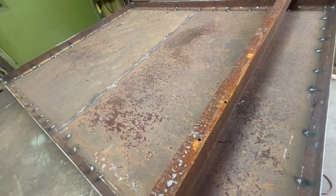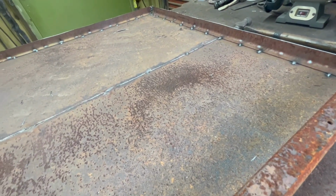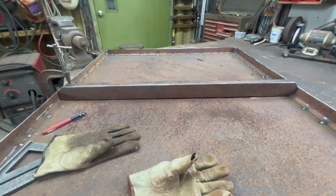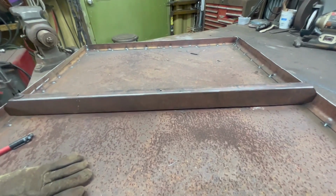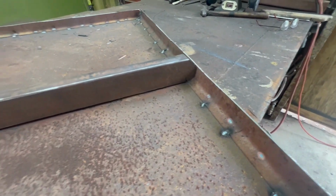When I flip it over, I weld it out. I'll have to cut the ends accurately so I can have good connections between there and there, and get the rust off of it and get ready to weld it. Gotta grind this little weld down and that little weld down, do some cleaning. It's gonna be okay. I got the wire brush on the grinder and got most of the grime off of this rectangular tubing. And I got the two ends cut and notched to fit.